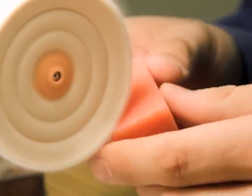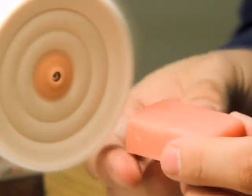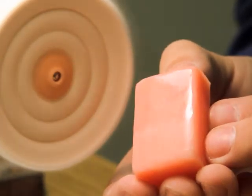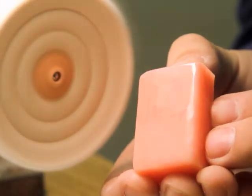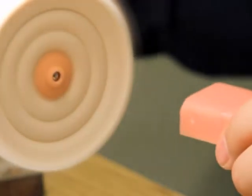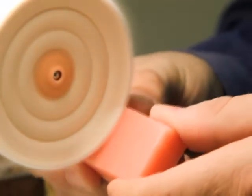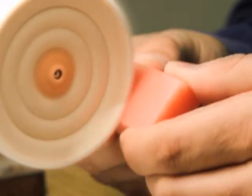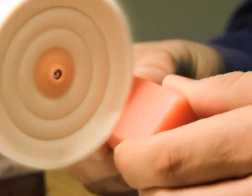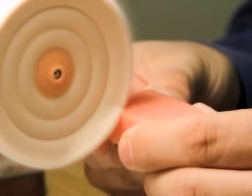So just keep working the buff in one area until the scratches are removed and the surface becomes polished. If scratches remain after the area becomes polished, simply add a little more material to the wheel and rework the same area until those residual scratches are removed and the area is highly polished. Now that we know what type of polishing buff to use — which is a rather firm one — and we've seen how important it is to work only one area until the continuum process of finish to polish has been completed, let's look at some additional hints.